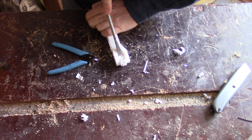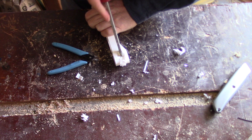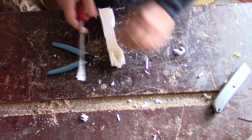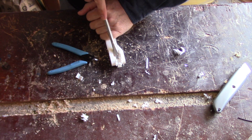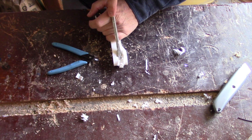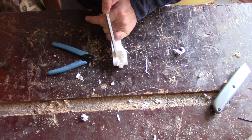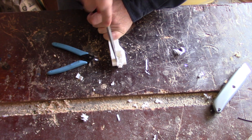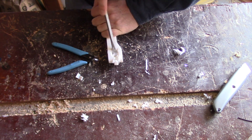You have to be really careful here with a screwdriver. One thing you don't want to do is twist. I'm going to pry up on the thick part where it has a lot of strength and gently try to pry it out. If it doesn't come then you have to stop and go back and snip the middle out to weaken it. What I'm trying to do is work my way and find a separation and then pry it out.